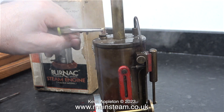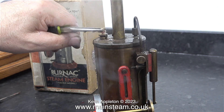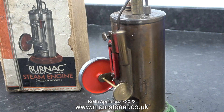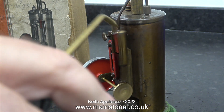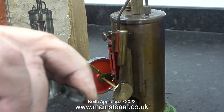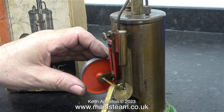Not unsurprisingly, this engine is very economic on steam. I'm going to test the safety valve — there's plenty of steam in there, plus a bit of water because the boiler is still too full. For lubrication, these type of steam engines require wet steam from the boiler, which quickly condenses to water, and that becomes the lubricant, and it is surprisingly effective.